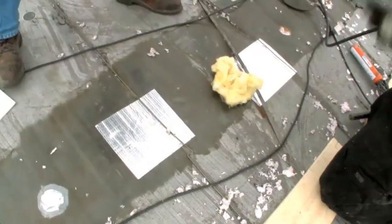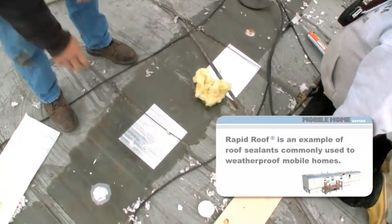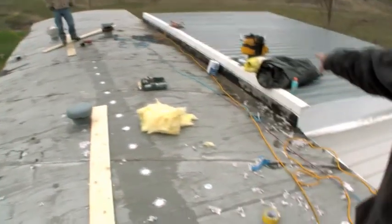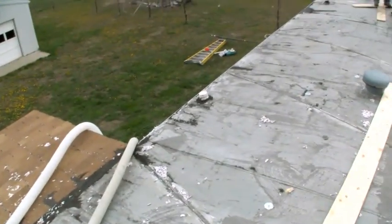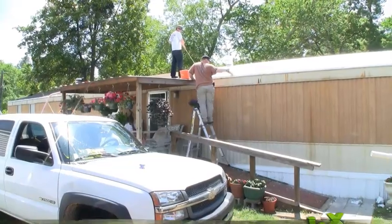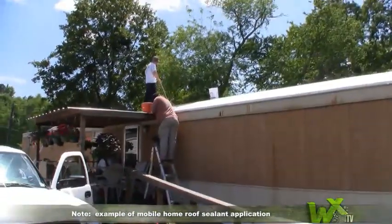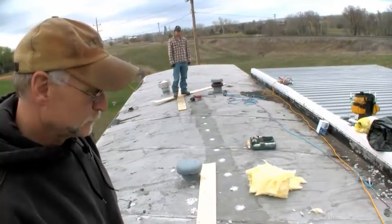After we put all these patches down like that, we come along and rapid-roof the entire patches and all the seams around all the flues, any mushroom vents, any areas like along the outbuildings or additions around the flue pipes. Make sure you catch all your seams and any spots you think might leak, and get them. Because like I said earlier, once you start up here, it's basically your trailer from there on, so do the best you can.